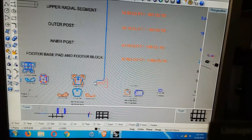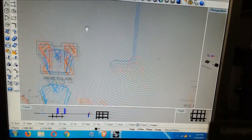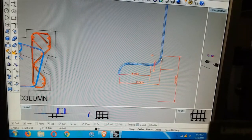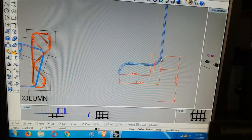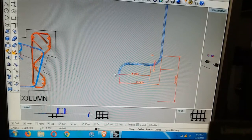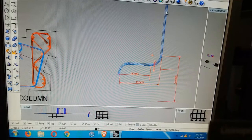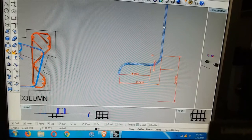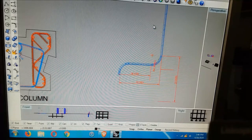And because we had all these legs the same height, it gives you a pretty wide base for your column, because these are fanned out all the way around in a rectangular shape. It's not really circular; it's more rectangular. You have to see it to believe it could be, but that's what it is. It gave you this wider base, and when we stood them up in there, they stayed there all by themselves. We put some 2x3s like over a stirrup and wedged against something on the other side, just to keep them honest. And once we got the forms up, all that had to go away anyhow, and they were tied to the top of the forms.